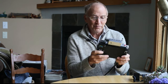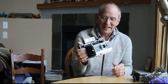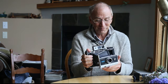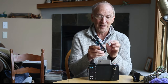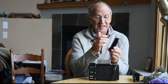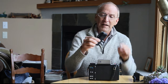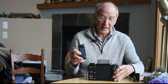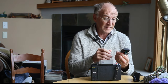Does it really work? I actually tested it out with a laser shutter tester and it seems to be pretty accurate. I also tested it with some film and the exposures came out fine, so I'm really happy with this iteration. It's not very expensive to build: the Arduino is about three dollars, a couple of switches are super cheap, the little screen is about a dollar fifty, plus various wires. I designed a 3D-printed battery compartment so you can just take the old one out and drop this one in with the hinge — installing it is really easy, no cutting required.